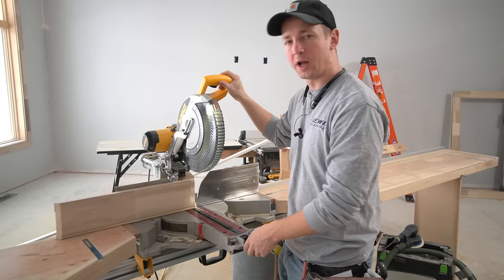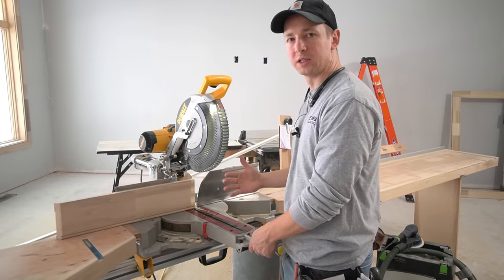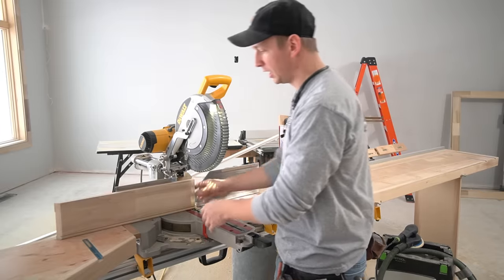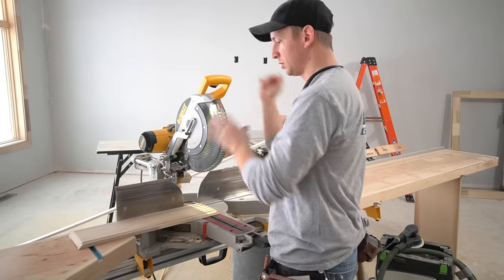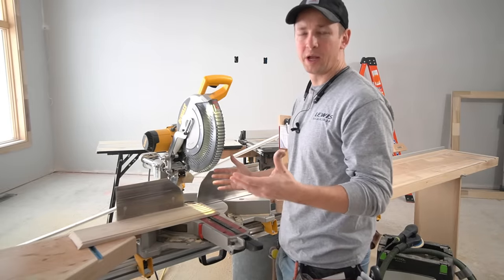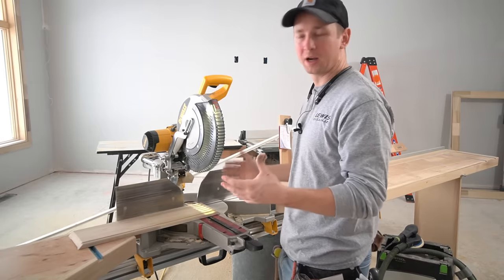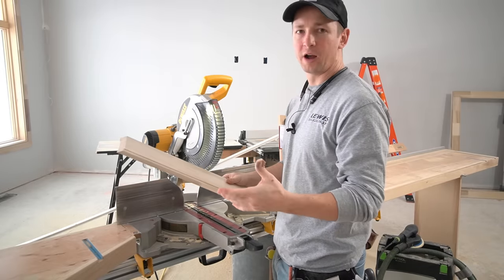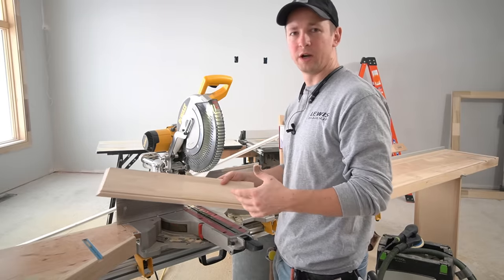For those of you who like to put a five-degree back cut on this so you're sure it's sitting nice and tight — it's a lot easier to do that in the vertical position than trying to put it on the flat and mess around with the bevel function, tilting the saw like that. For me personally, being completely honest, I'm installing paint-grade trim and I've never felt the need to put a five-degree back cut on this straight portion of the baseboard profile. I feel like I'm getting things plenty tight just cutting that at zero degrees, and it works just fine for me.